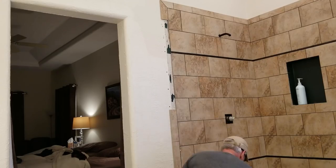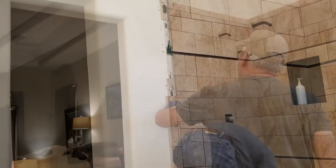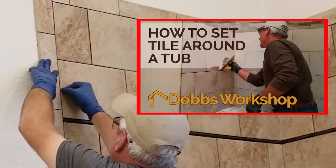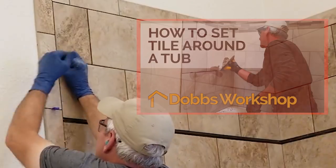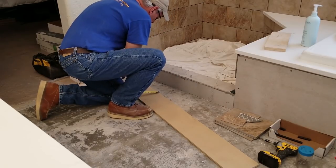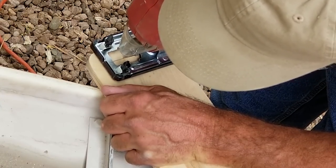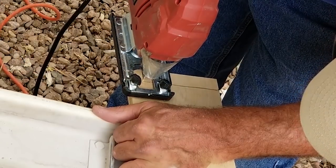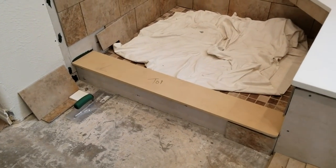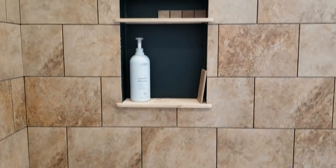Bullnose trim is a great option for giving a finished look to any tile installation. If you don't happen to have bullnose available for your tile, you can still get a nice looking finish by using a process that I call back-cutting the edge of the tile. You need a tile saw to do this very efficiently, and I'm linking a video in the corner that shows this type of installation. Before I can finish out the step and niche for the shower, I have three pieces of quartz being fabricated — the same material, just a thinner version of what we used on the tub deck. I cut templates for the fabricators and dropped them off at their shop a few days ago. So once those are in place, I can make the remaining tile cuts needed to finish out the shower. I'll show that in the next video, where I'll install 18-inch tile on the floor and run it in a diagonal and stacked brick pattern.